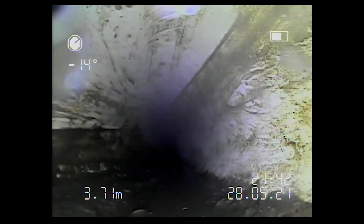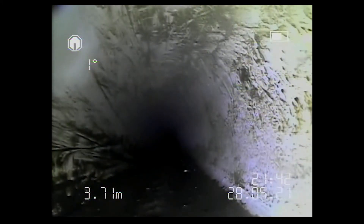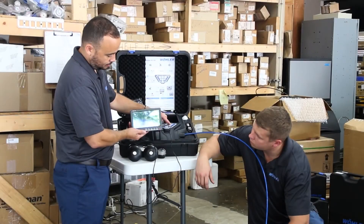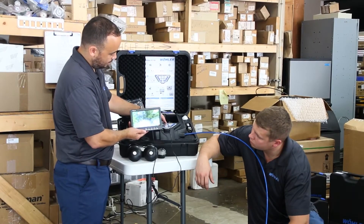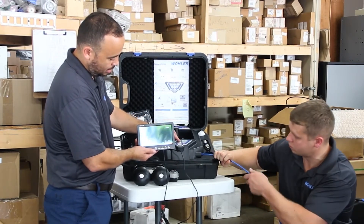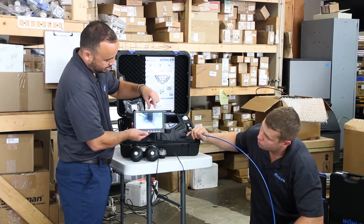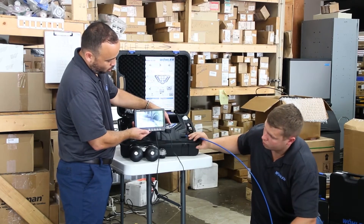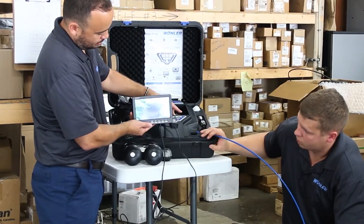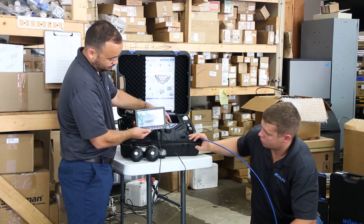We're now looking downstream of the pipe itself, and from here we can look at the walls if needed. You still get pretty good illumination there. We can scroll back and go to the center position. We are now laying linear to the pipe itself — and if you look, we're actually upside down at this point; the water is on the north side of the screen. So I'm going to orientate the pan and tilt head so that it is exactly how we would be viewing it without the camera system.